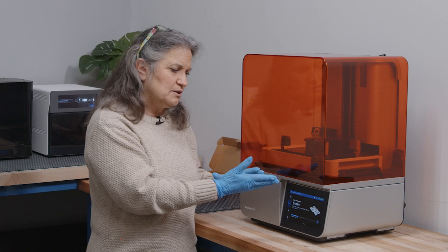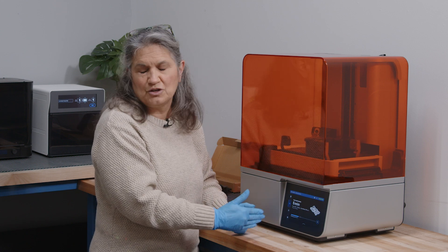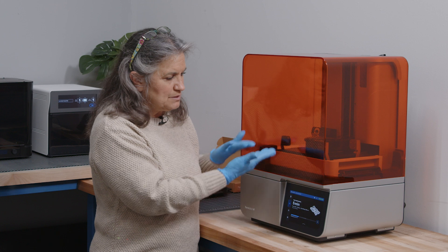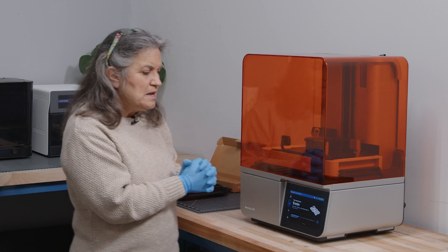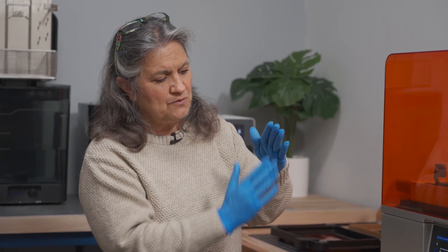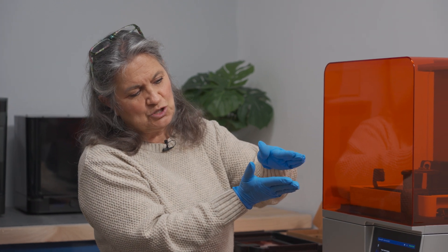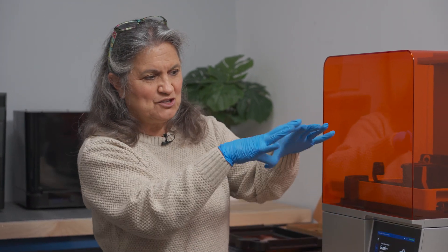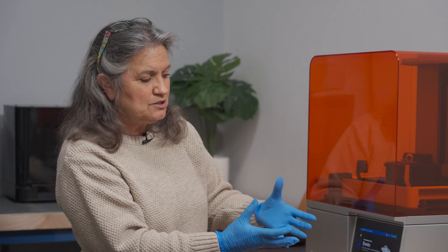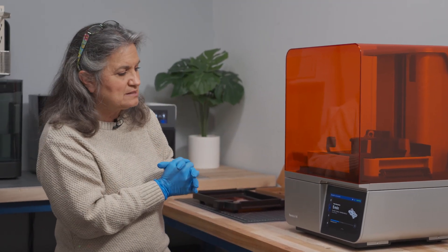Before, if you printed on supports or at different angles, you would do that to increase the number of prints you can get per platform. But with this, you're not going to have to worry about that. Because if you're using a lot of vacuforms — if you're at an angle and on supports, you have to sink that base into the beads of your vacuform, and that takes time. And if you've got a model that's too tall, as you're sucking that down it changes how the plastic can form around there. This way, you've got a consistent model and it just helps with the post-manufacturing process as well.